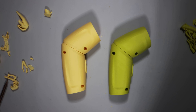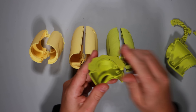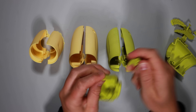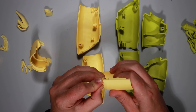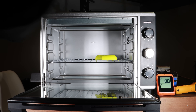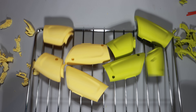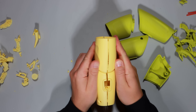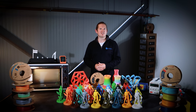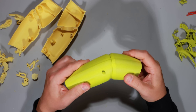To demonstrate this, I've printed two identical drill housings on the same printer with the same file using standard PLA settings. The support removal is extremely easy and perhaps even better than regular PLA. When we anneal the parts in the oven for 30 minutes at 100 degrees C, we can see the regular PLA housing deforming during the process. Once they've cooled down, it's clear to see massive gaps in the seam lines, making reassembly of the drill housing impossible. Comparing this to the HT PLA GF housings, we can see a very clean seam line as the two halves snap perfectly back together.